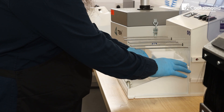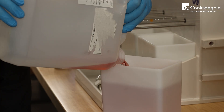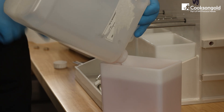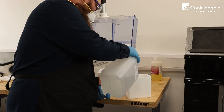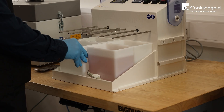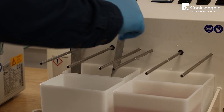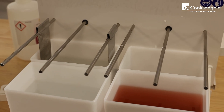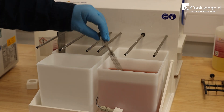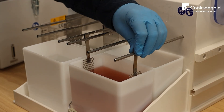Container three: gold plating solution. Start by adding the base solution of 900 milliliters of distilled water, stir thoroughly, then add the gold plating salts and mix until fully dissolved. Container four: final rinse — this is just distilled water. Insert your anodes into the appropriate baths and secure the jewellery to a jig or copper wire.